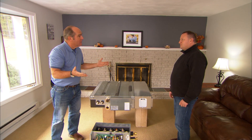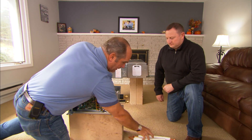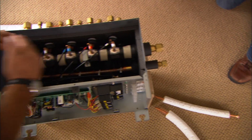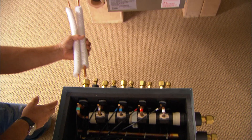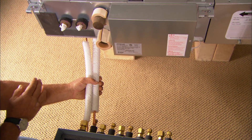The reason we did it is because we can — the refrigeration is so straightforward and easy. From the outdoor condensing unit, we're going to have one set of larger-sized refrigerant line sets that takes heat in or out of the building. Then we come to this branch box right here, which is really like an electrician's circuit panel. We can go up to five indoor units with small refrigerant line sets. When we're done, you'll end up with four zones on this floor, each with their own control, efficient heating and cooling, filtration, and dehumidification.